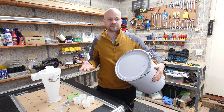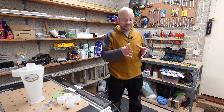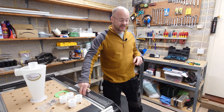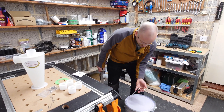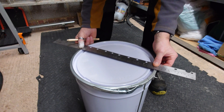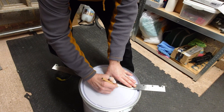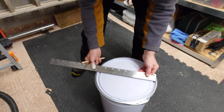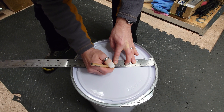So where do we go from here? The first place to start is finding the center of your lid for your bin. You want to find the center because this keeps the center of gravity in the right place and keeps the whole suction equidistant within the system. To find the center, it's quite easy on a bin like this because it's got a handle on it. The handle runs straight through the middle, so all you have to do is take a steel rule, tape the line between the two points of the handle, draw a straight line in the middle, then measure to find your center point. It doesn't have to be exactly bang on, but it's always good to get it close.